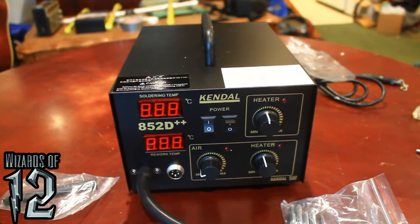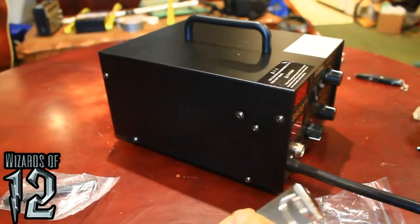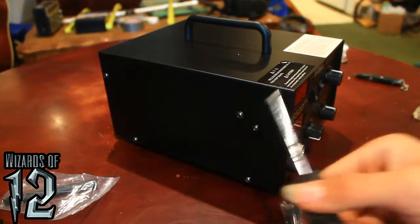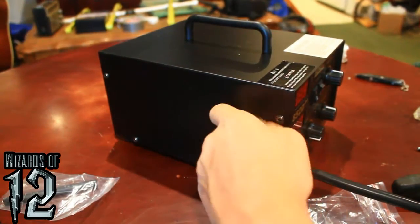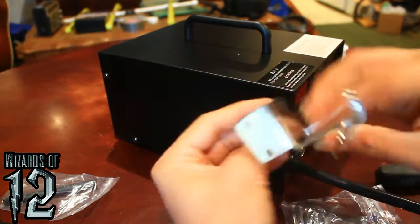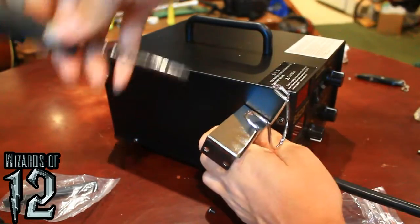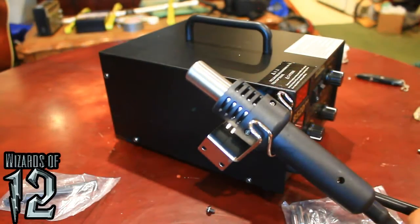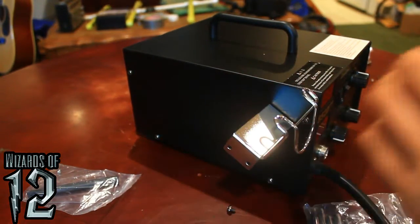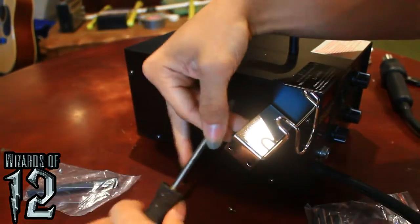The next thing we have to do is attach the heat gun. In this case I'm going to attach it to the left side, and you can see there's already screws in there for that. So now I'm going to unscrew these two M3 screws. Chinese are quite fond of metric. I'm going to use one of these screws to hold it in place so I can get the second screw in. My long nails will help me out here. Let's make sure this docks up correctly — and you can see it fits perfectly in there. Although in practice you're supposed to have them the other way, but I don't want this thing getting me in the face so I'm going to do it the improper way. It can be configured to work either way.